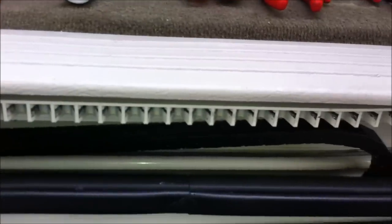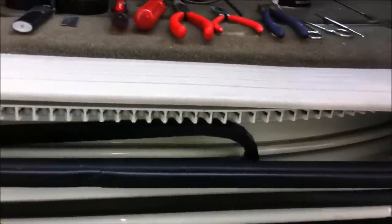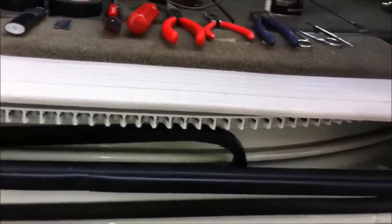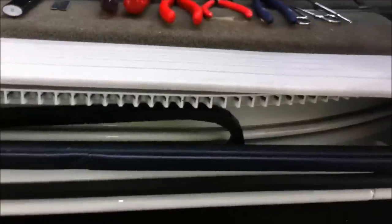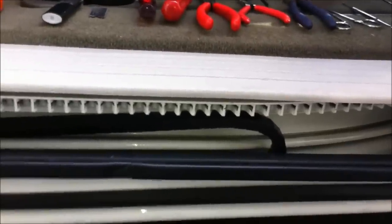The problem is that after a while of using the door, the wires going back and forth actually break on the inside of the insulation — you won't even be able to see that the wires are broken. The door will just suddenly stop working. The other day I got a notification saying my door was open four hours after I left; I had pressed the button thinking it closed, but it stopped almost a foot short, leaving my vehicle unlocked for four hours.